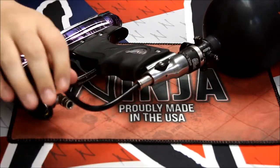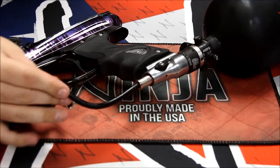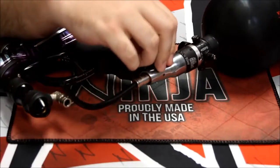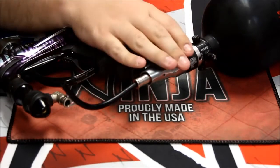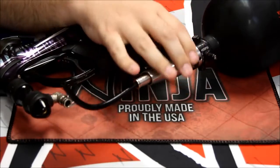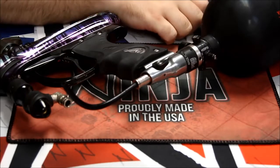Before we do anything, we of course want to make sure that your system is empty. One of the nice ways to do this is if you have a macro line gun, you can pop this macro line out here and activate the system. This will allow the air to vent through here. Now keep in mind, this will cause your reg to get quite cold and have some condensation on it if you're draining a lot of air. Just make sure there's no air in the system.